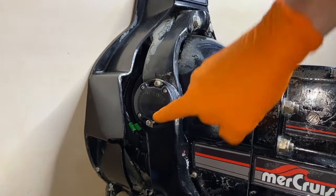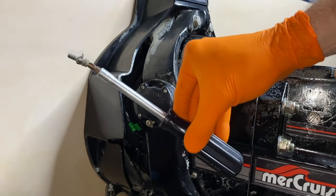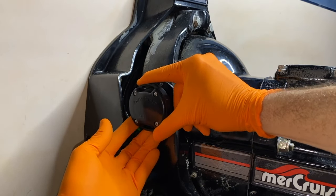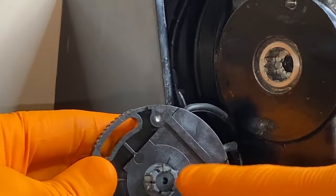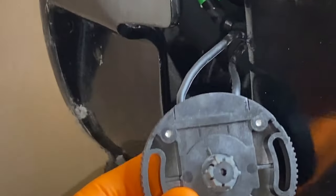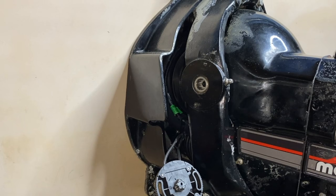Here on the port side you can see 'trim limit, port' with two Phillips screws. Go ahead and remove them — it really helps having a magnetic bit. Pull the trim limit straight out just like the starboard side trim sender. On the back side you have the inner rotational mechanism with a notch and the beveled notch on the inner wall — carefully adjust and align those. Then carefully rest it down on top of the hydraulic lines. Next, hop back in the boat and turn the wheel full counterclockwise to re-expose the gimbal ring where the trim sender switch secures.